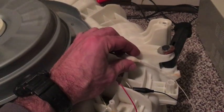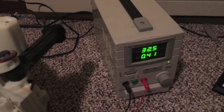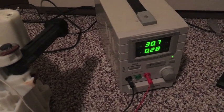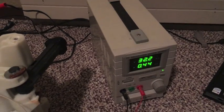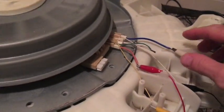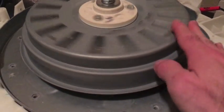One other interesting thing: when I disconnect one of the coils, the amperage really doesn't drop that much. Right here it's about 0.45 amps, and with one disconnected it's about 0.35 — it kind of hovers around in there. So by adding that one extra circuit it's only using a tenth of an amp more, but it's almost double the amount of torque. If I disconnect one of these, I can stop it pretty easily with my hand — but with both circuits running there's a lot more torque.